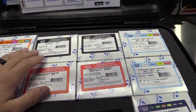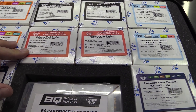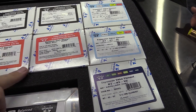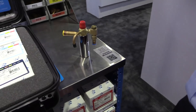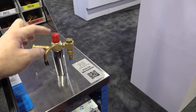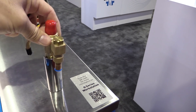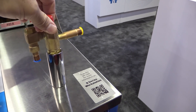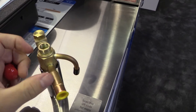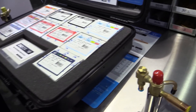Personally, I don't use the flare bodies very much, but I still have a BQ body in there. I keep the SBQ body. The SBQE is the most common — that's on walk-in coolers, and that's an externally equalized valve. Or the EBQE, which is the straight-through body. I prefer the SBQE because it has the removable strainer. That's always been a big feature. With us not always following proper practices, we've really run into that problem. These valves are completely disassemblable — you can put in whatever cartridge you want.